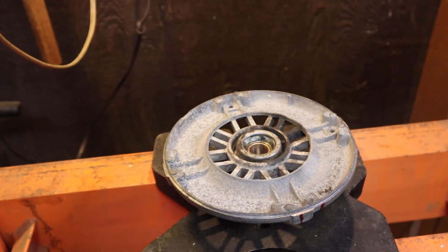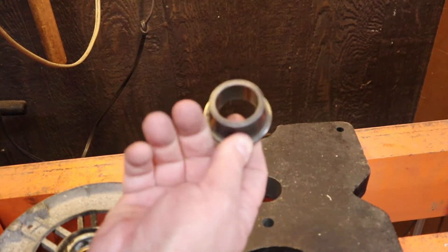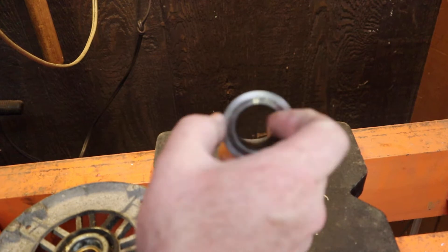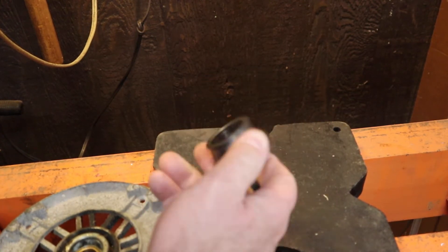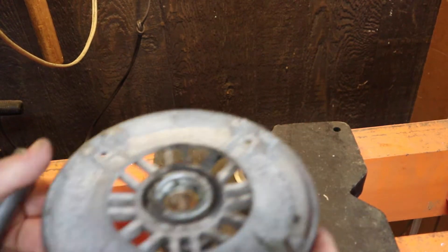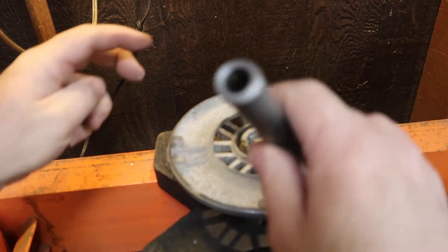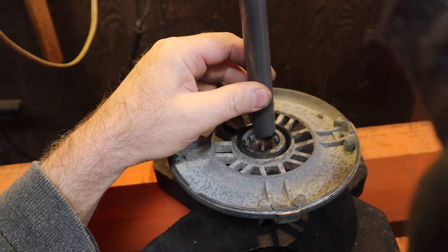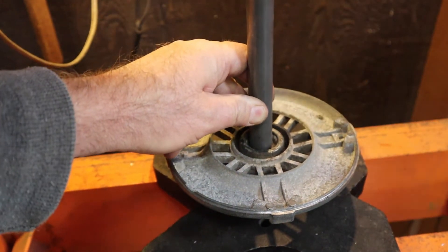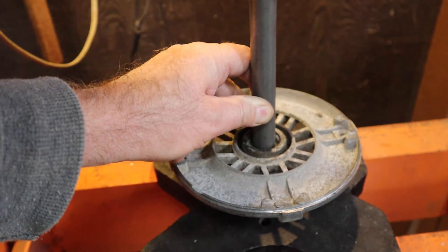Here we are set up over on the press. Here's our motor end bell with our bearing that's got to come out. I love using these old bearing inner races — the outer races often work too for pressing out other bearings. When you do a bunch of bearing work, hang on to a few of these because they make fantastic little spacers for when you've got to press out a bearing on a press. This is a cheesy little Harbor Freight press — do not ever buy one of these, they are absolute junk. Maybe someday I will do a few videos on how to improve it.